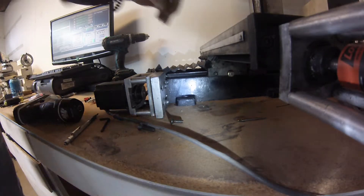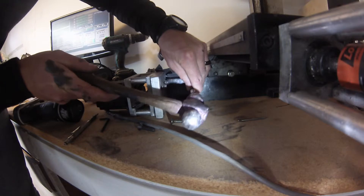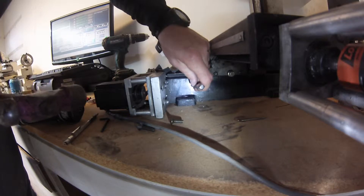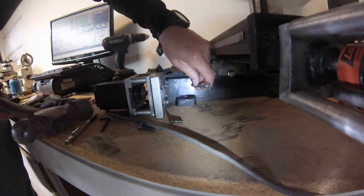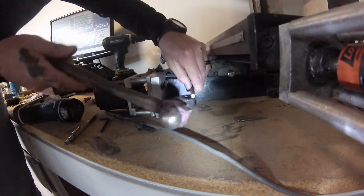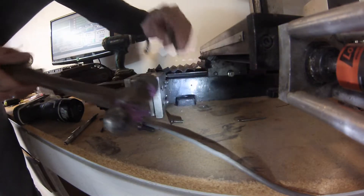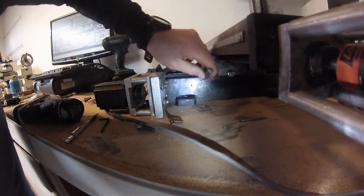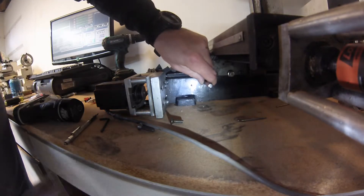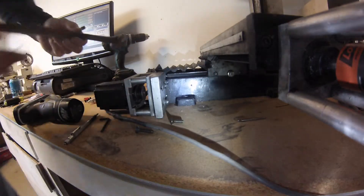I give it a much more stern strike to help guide the bit. This is actually at a slight angle — a couple degrees — and I need to drill this relatively straight. So I'm going to hold my punch straight on there; I'm not going to follow the contour. Give it one good hit. This is cast iron and it's pretty soft, so it doesn't really take that much of a hit.